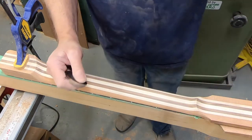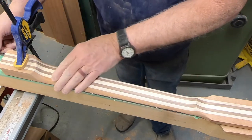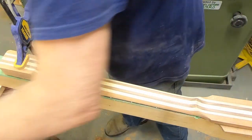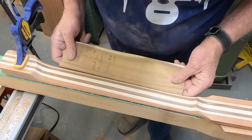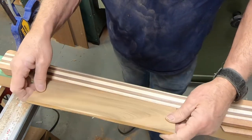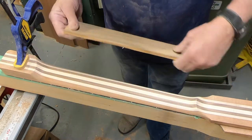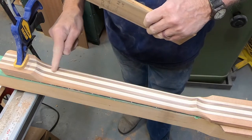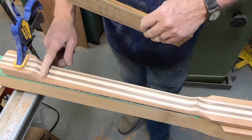That's where I'm at. I'm probably going to call it good for now, although it's still not perfect by any means. I keep a short block with a straight edge handy and I can look and see how I'm doing. This block isn't a hundred percent — it's got a little wobble in it — but it's good enough to tell what I'm doing. You can tell when you go like this — there's a pencil line right there — I need to flatten this out. It's picking up a little bit of a rise right there as I move up toward the heel.